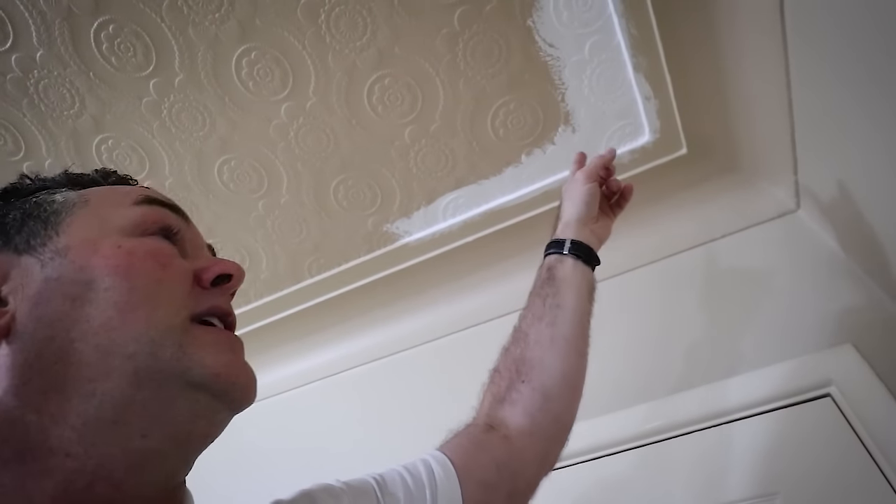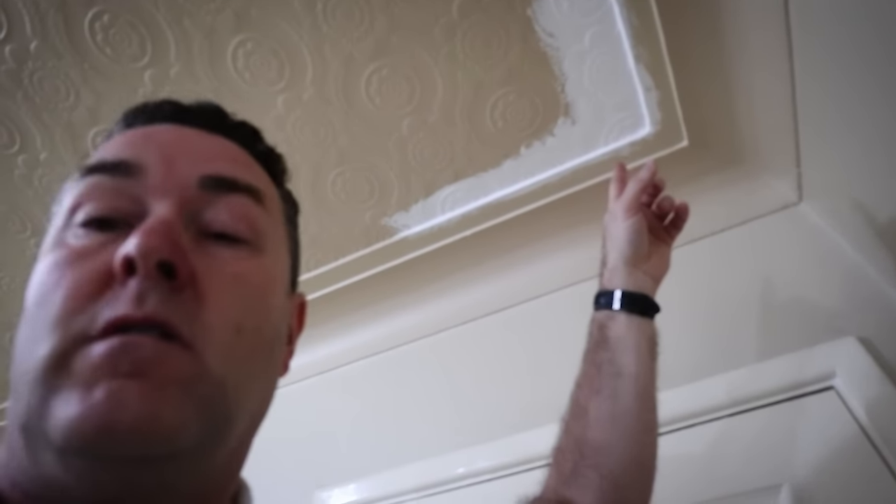My dad says it might be patchy when it dries out, which it possibly would be with a darker color underneath. I want to go around, get all this cut in, and then get the roller. I'm not one of these that's wetting their roller in, and I'm not one that washes their roller out - particularly with a used bedded-in roller. What I do is actually load the roller up and leave it in the bucket on the wire so it's soaking in and the paint penetrates the roller element, so I'm not rolling out loads of water.